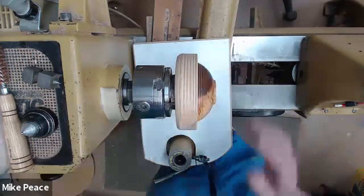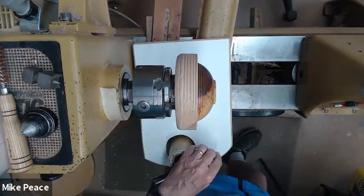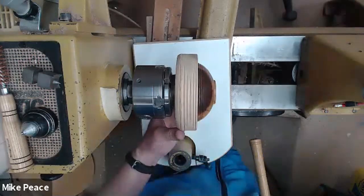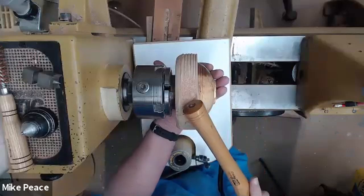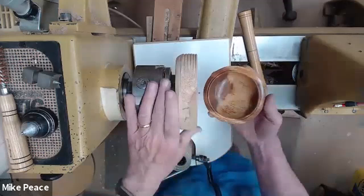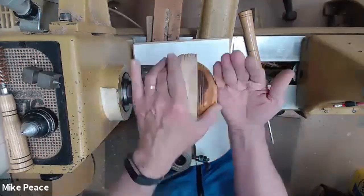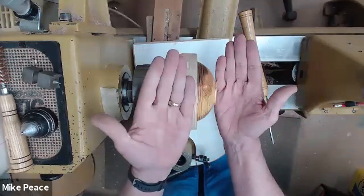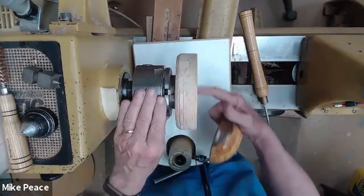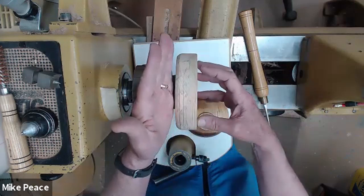So for example, this little bowl is dry, and I turned that, I don't know, when I go back and look at a video I made for Gwinnett Woodworkers, I had this same little bowl and chuck in it, but if you tap it, it'll come right out. You line it up with the same grain orientation. In other words, the bowl grain is running this direction. My jam chuck is running in this direction. And this piece right here could be another bowl, a larger bowl blank. So you're using it temporarily.